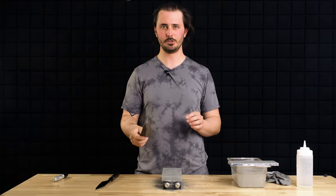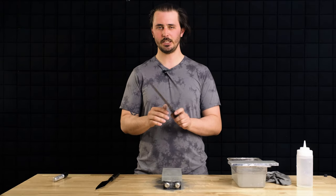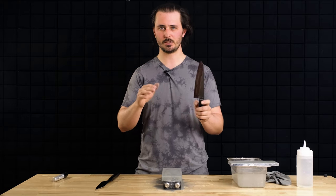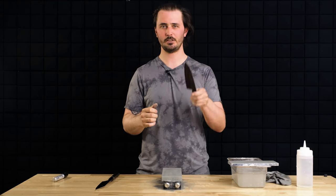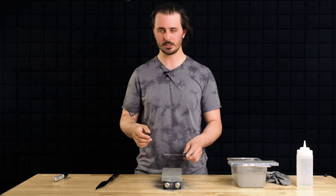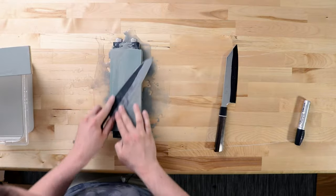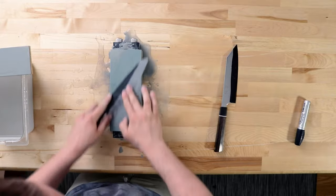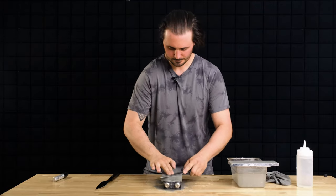There are two ways to do the backside of your knife. You can continue using your right hand, simply flipping the knife over. I actually find that switching to my left hand for thinning is a lot easier than you might think and gives me better results — the scratch patterns are much more natural looking and better match what we have on the other side. There's also not as much wrist control needed when thinning the bevel compared to sharpening the edge. We're also going to be giving these knives away — we'll send them to our master sharpener Ben to polish them up. All you need to do to enter is leave a comment down below.